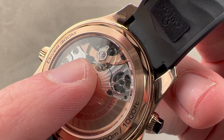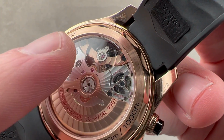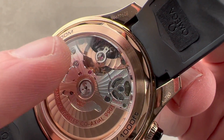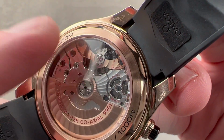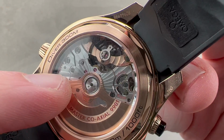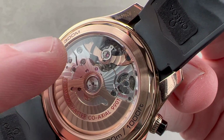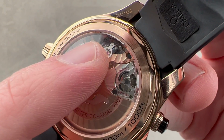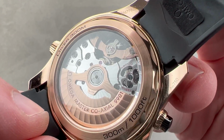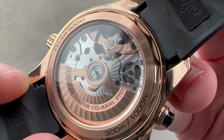We have a coaxial escapement tri-level. It's a double impulse, direct and indirect impulse, tangential contact escapement. So it extends power reserve, 60 hours here, reduces maintenance requirements, and improves chronometry. And it was George Daniels' invention back in 1974 when he first conceived this, and industrialized by Omega in 1999. It took them a few years to get the hang of it, but these new tri-levels, which have been in production since 2007, are the best yet, and they truly realize all the promise of the Daniels original.